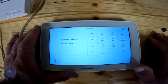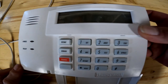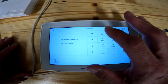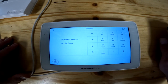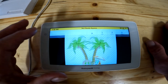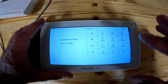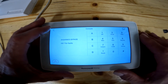Console mode: when you click on it, this is going to take you back to an old school keypad — basically like an old 6160, 6150, or 6148 — and this lets you punch in the numbers like you used to. If you used to hit 1-2-3-4 then 1 for off, or use the stay/away buttons, you can do that from here. As a user, you don't really need to get into that because you can change your time, date, add codes, add users, and change master codes all from the other menu. But for an installer, this is a good way to program your system without having to grab a separate 6160 keypad.